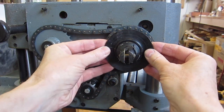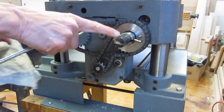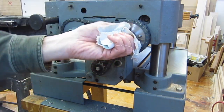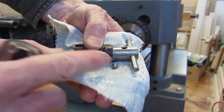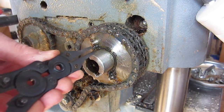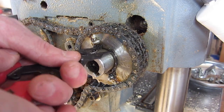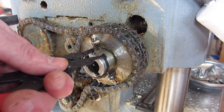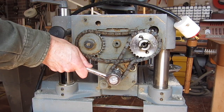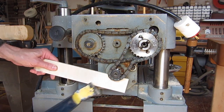Remove this rubber ring by pulling it straight out. Remove this ring with a two and a half millimeter hex wrench. To remove this piece, wrap a cloth around it and pry it out. The reason for the cloth is there's a ball bearing inside which you don't want to lose, and a spring — without the cloth that might shoot out. With that out of the way we've got a clear view of the circlip. I've got a very cheap circlip tool here. Undo this with a ten millimeter wrench — you might need to jam a board in to get something to turn against. Now we can pry this gear loose.